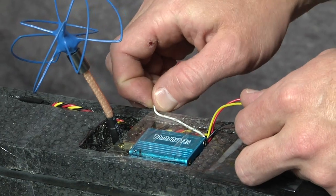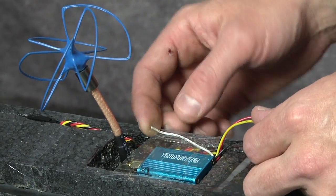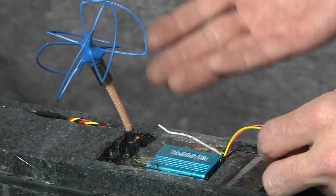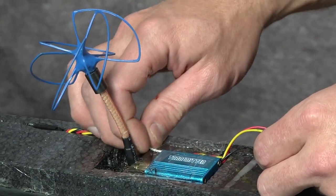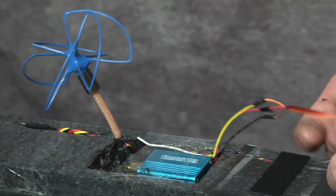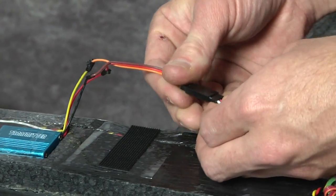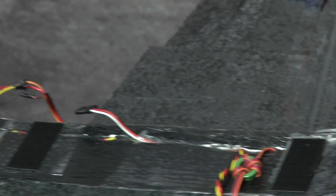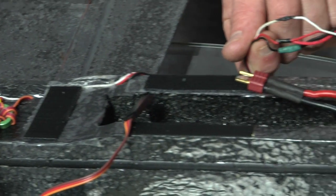What about this white wire? I've had this white wire that I don't seem to say much about — that's for audio. White is always audio. Since I don't fly with a microphone or audio, I simply don't connect it. Some people will ground it; I just leave it floating. That way, if I need to move or extend wires, there's just a simple servo connector that runs all the way up to my power bus in the front.